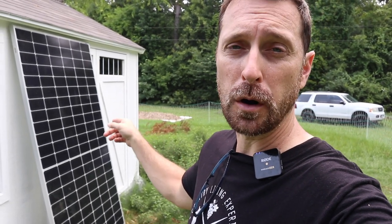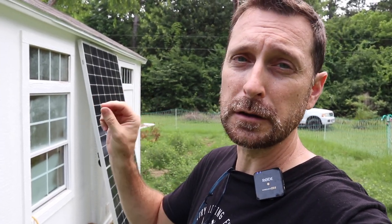For reference, I've got the SolarEver 455-watt split-cell panels — the same ones I have for the house, although those are just a little smaller at 440 watts. Yesterday I spent some time adding this air conditioning unit to the space and I'm starting to insulate it. That is very important for the operation of the equipment — you need a space that stays within the temperature parameters of the equipment you're using, as the system will put off some heat itself. I'm also sealing up every crack and crevice the best I can, not only to keep the temperature regulated but to keep dust out of this space.